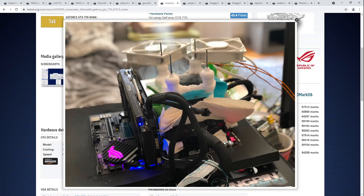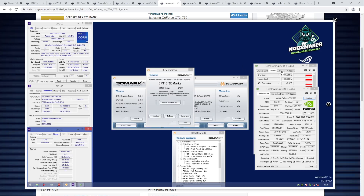The GPU is not just running at stock, but the CPU is definitely the star of the show here, doing 6.6 GHz on an 11900K, eight cores, eight threads, memory doing 3866 12-11-18 — so gear one memory mode, with the memory controller synced with the memory frequency, which gives you better memory latency than running desynced. However, I'm not actually sure this is necessarily the best way to run 3DMark 06 — Noisemaker himself said he was just trying gear one and doesn't know if it's better.